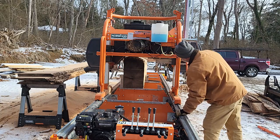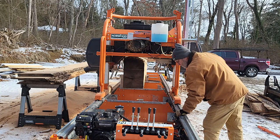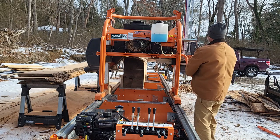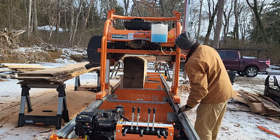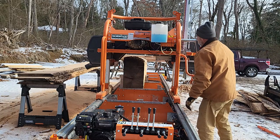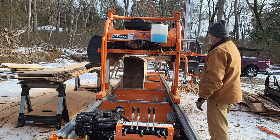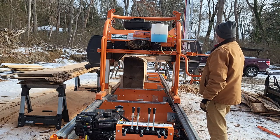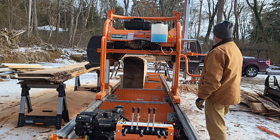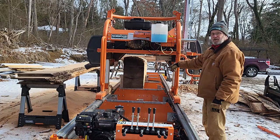That's going to give me that 6.5 there. I want that 3.5. So let's add another 2 to that. 14 3/4, 16 and 7/8, right there. Actually, that looks like a reasonable process. So what I want to do is, and then I'm going to take 2 2-inch flitches out of it, and that's going to leave me 6.5 on the bottom.